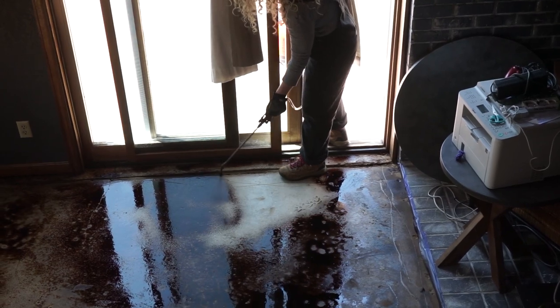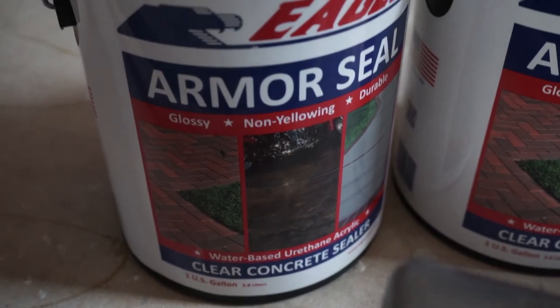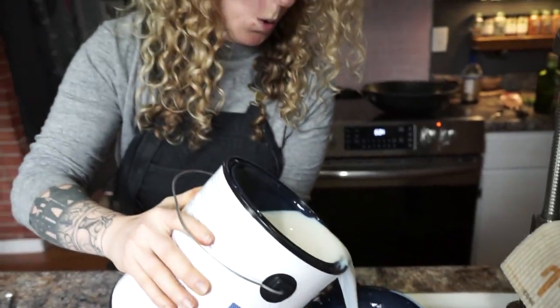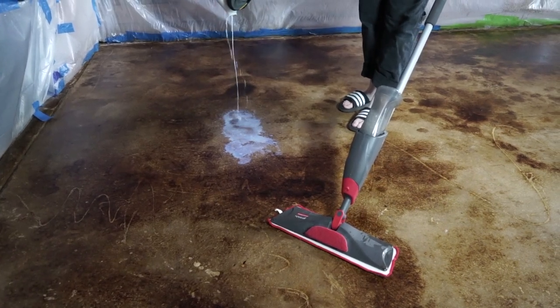The dye comes as a concentrate and you add it to a sprayer — the same kind you'd use for non-toxic weed killer — and you spray your floors with that. After that you'll apply a top coat a couple of times and then polish. I opted for a color called maple, because of the name. I did two coats of dye, leaving a couple of hours between each coat, and when you spray it you kind of want to be indiscriminate with how you spray to give it that intentionally imperfect look.